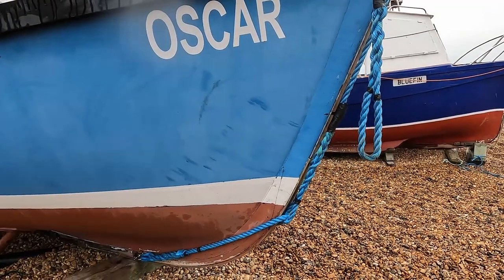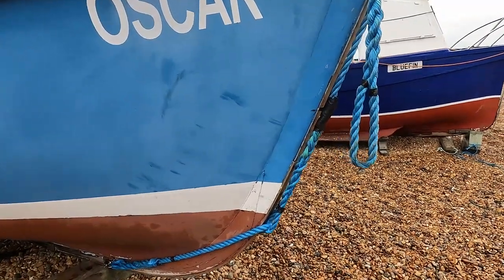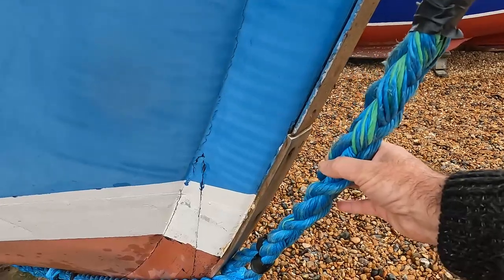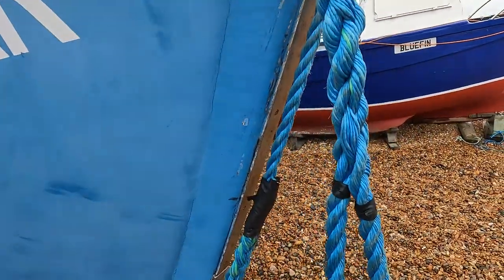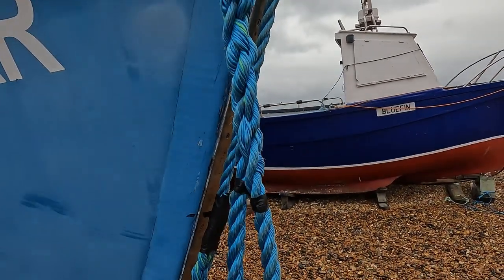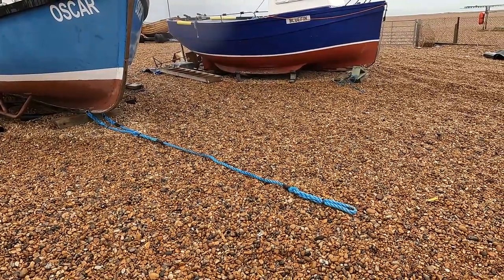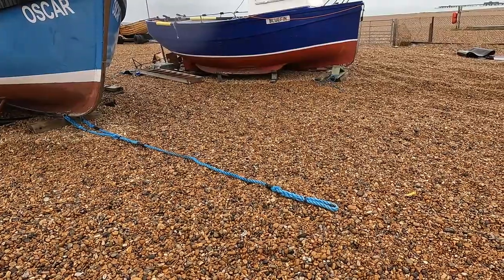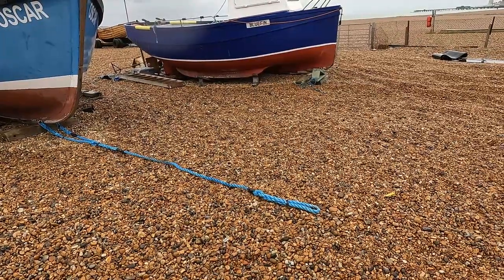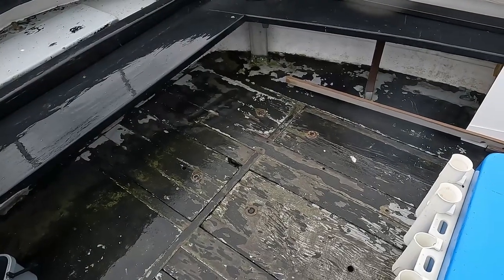This is probably an important part of the boat - obviously for lowering me down and pulling me up the beach. You need to check to make sure there's no frays or any cuts in the rope, because the last thing you want is it snapping when you're pulling with people in the way. We also make sure the painter is not as long as the boat, because when we throw the rope to the beach staff as we're landing and he misses, it washes back under the boat and doesn't get trapped around the propeller.